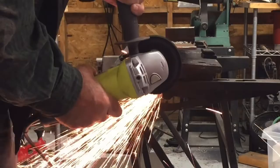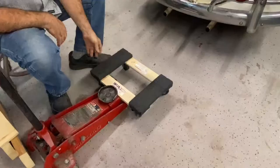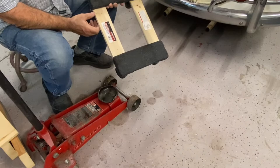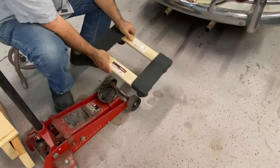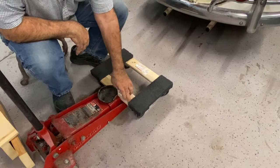I'm going to use as a foundation for my engine cradle one of these mover's dollies. This one I bought at Harbor Freight on sale for around ten bucks — normally they're only fifteen dollars. It's rated for a thousand pounds and has four fully swiveling casters. It'll fit over the jack wheels, but this one brace piece of wood is going to be in the way, so I'm going to cut it away to make it U-shaped, while still tying the wheels together so they don't spread apart.